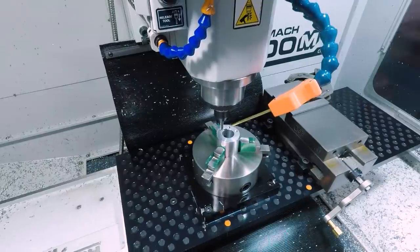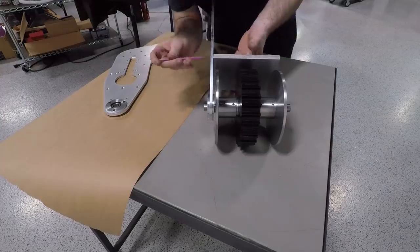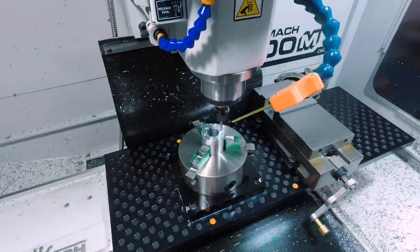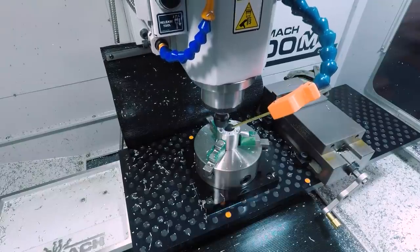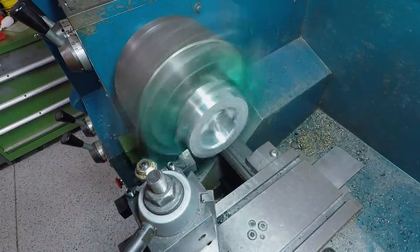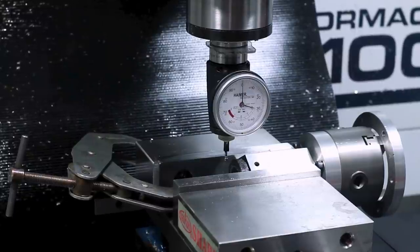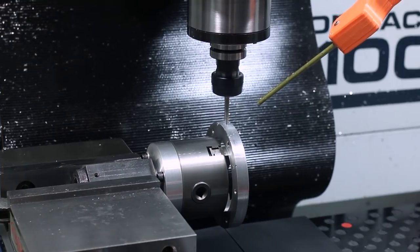We used that same powder coat tape and a chuck on Widget 239, where we're making a drive wheel for our Johnny 5 robot build. We turned the part, broached it, and then coated the three jaw chuck jaws with that powder coat tape again to allow us to clamp with minimal or no marring on the part. In Widget 248, we were making a toe tip tube for Johnny 5, and after finishing on the manual lathe we used the six-sided hex 5C collet block with a chuck on the end of it — so you can get creative; these don't just have to be used directly for raw material. That let us index the part the requisite number of times to get the holes drilled and tapped.